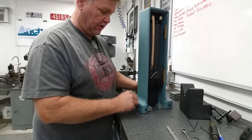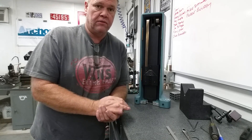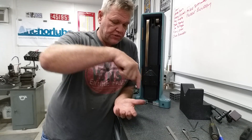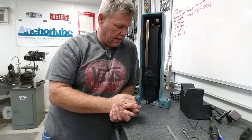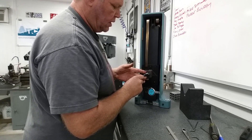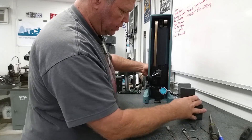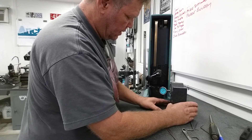This is what I experienced: I got my column in where I thought I was close enough and went to dial it in, but I cranked that foot down and reached the bottom of my travel. Then I started unscrewing the entire module — this is a little cartridge that threads in there — and it started feeling real rough and jumpy. I had to basically pull it out, get it to the center of its travel, and start over. I've got about an hour into this thing just getting the column square, centered in the groove, and dialed in again.